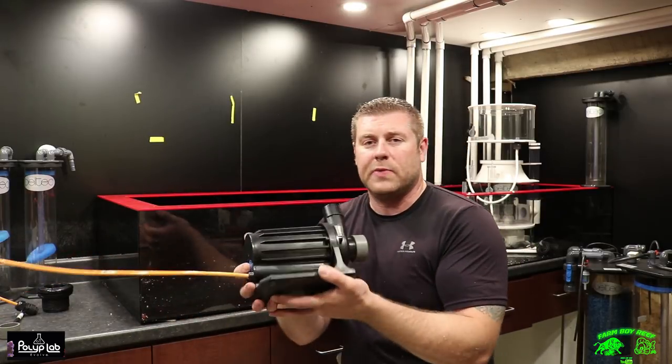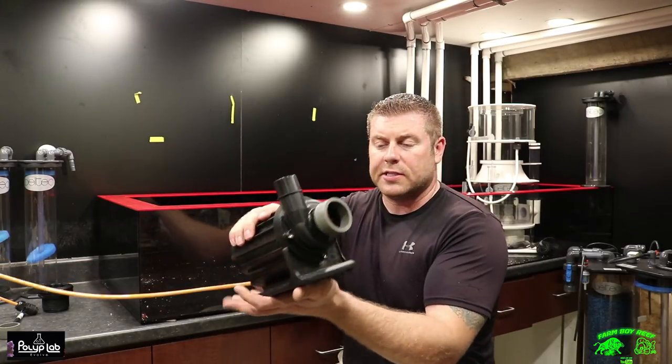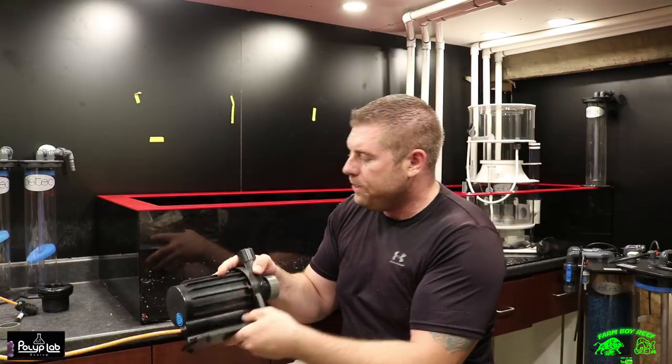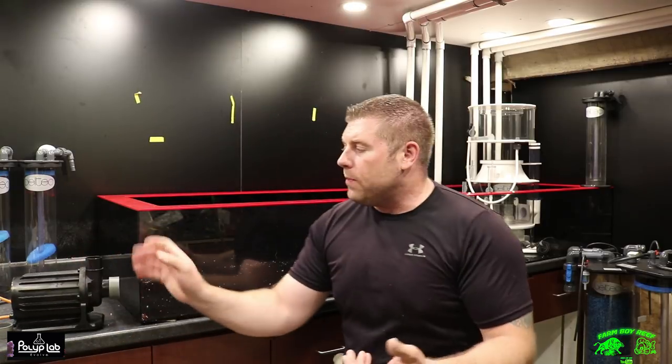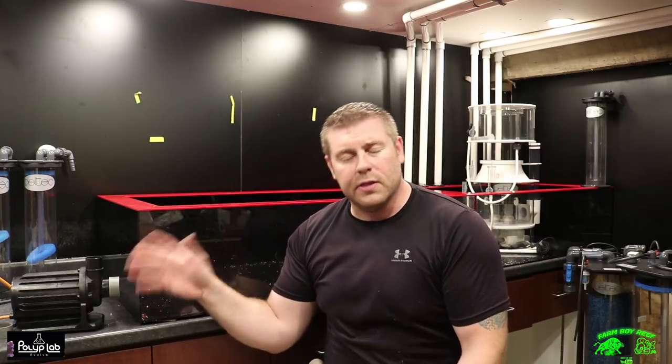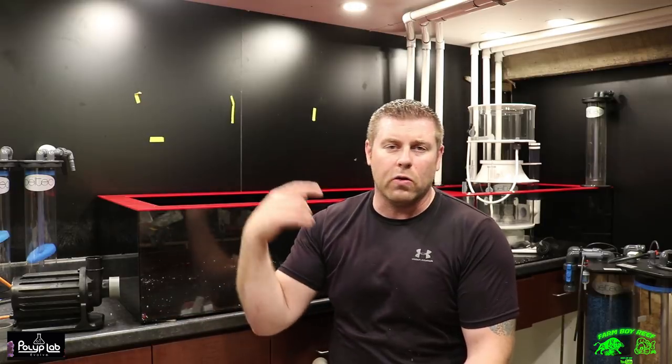You can see from my previous video, we did the unboxing. This thing's a beast, lots of power. I can't wait to show you guys how we're gonna hook it all up. Anytime you're doing a pump, you always wanna have some kind of union fitting. So I want the specs on this pump here. The inlet on it is a 2-inch and it's 1.5 inches on the outlet. So I'm just gonna keep it the same way they're speccing it.